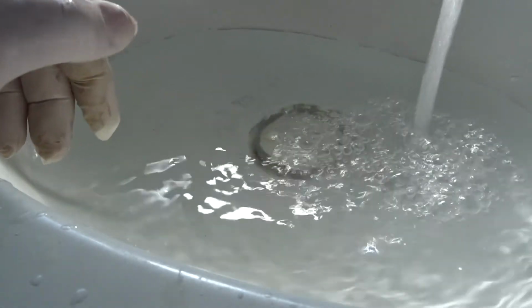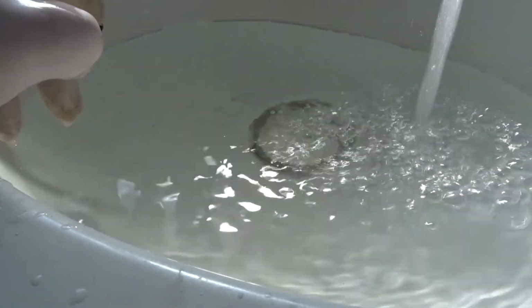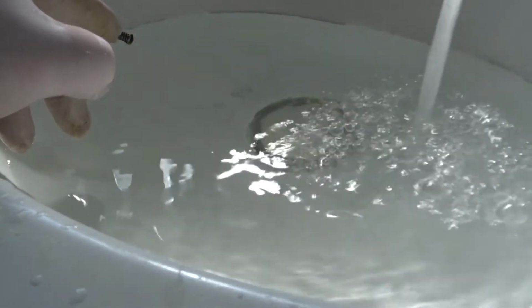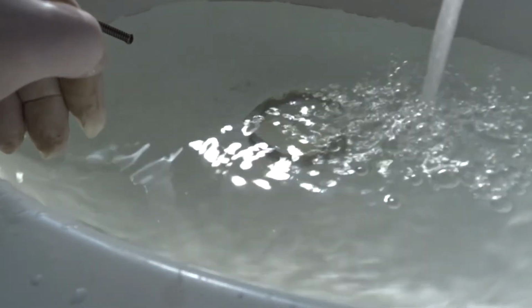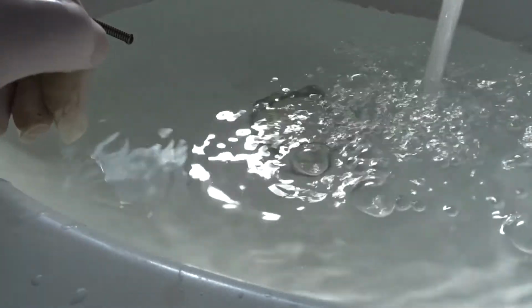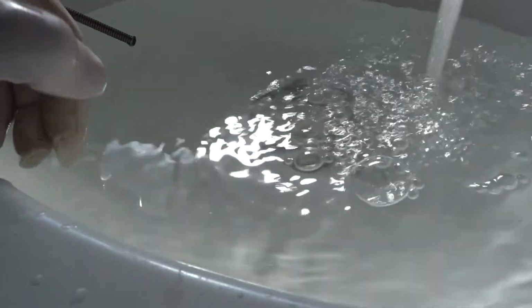What would be ideal is, obviously, when it lets go, you poke this wire drain cleaner down there, and you think it's unblocked. Sometimes you just shift it a bit to let the water flow through, and as it unblocks it, you just push the blockage down the pipe a little bit. So that's why I'm following up with it here now for a second time.